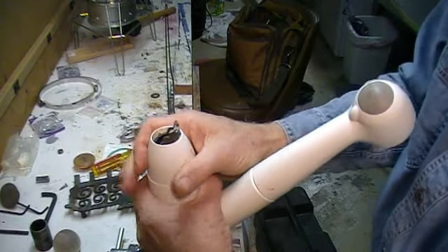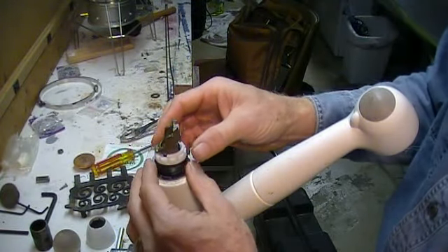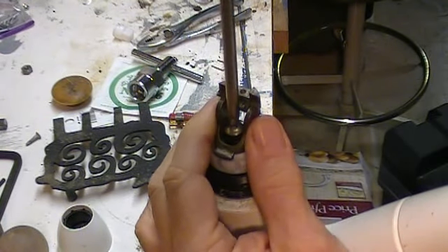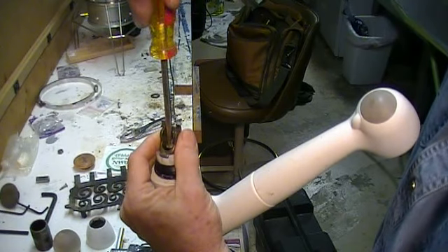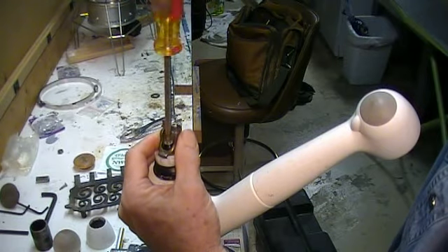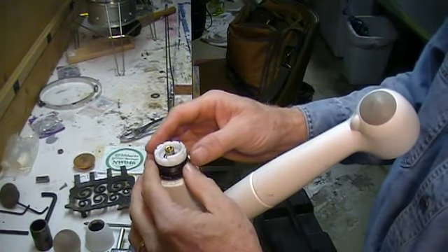Then there's a little decorative piece here that just screws off. This handle transition piece — we've dealt with it before. The next piece to come off is actually this lever, and again there's a screw in here that holds this down and is frequently also set in initially with Loctite, so it can be very hard to move. Our handle lever piece is now off — always be paying attention to the way that things come off.